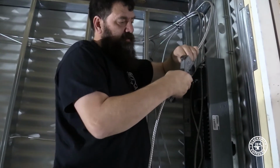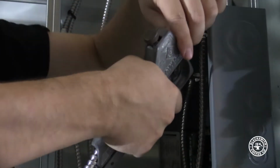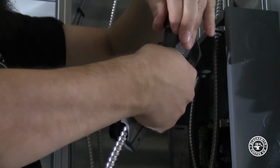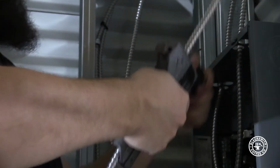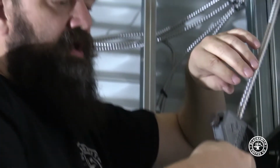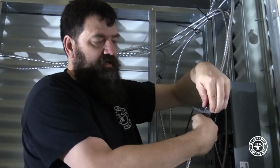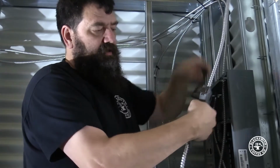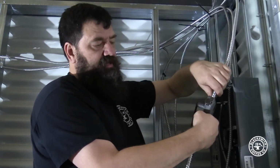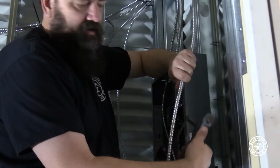And I've already showed you this a little bit. You got the wheel in there, you line that up, get it in place, and you just crank that, and when it gets easy, you know you've cut through. The problems that I was having are all about this adjustment. So if you're not cutting all the way through it, tighten this up more and get it to where it cuts through there. Then, to take it off, you basically just slide it back, and that'll come right off.